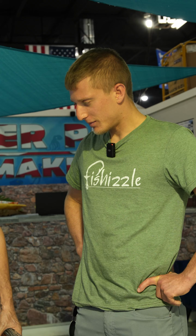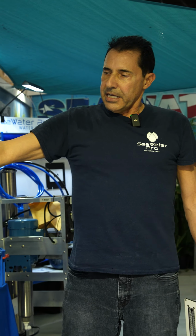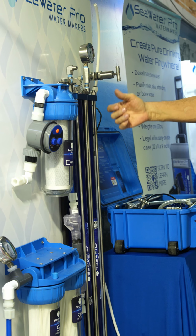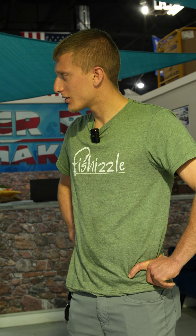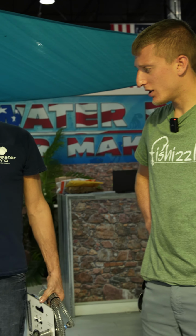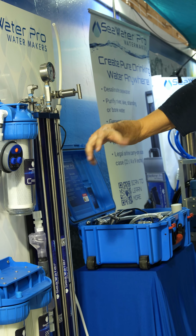Understood. Another question we get a lot is, well, how often do I have to rinse the system? Rinsing is really a fancy word for moving the old water out. If you turn on the system for 5 seconds every 3 days, you moved the old water out, you replenished it with fresh water, you rinsed it. It doesn't have to be a fresh water rinse. Any way we can get the old water out, because if we leave the seawater in this membrane, it's going to smell. It has microbial life that starves of oxygen, and then it starts smelling.